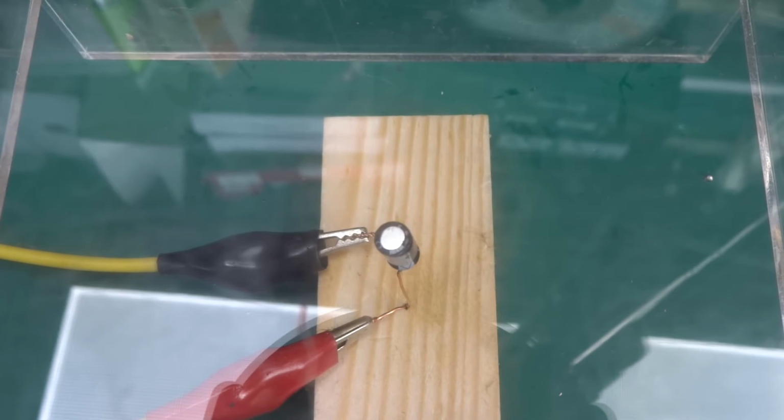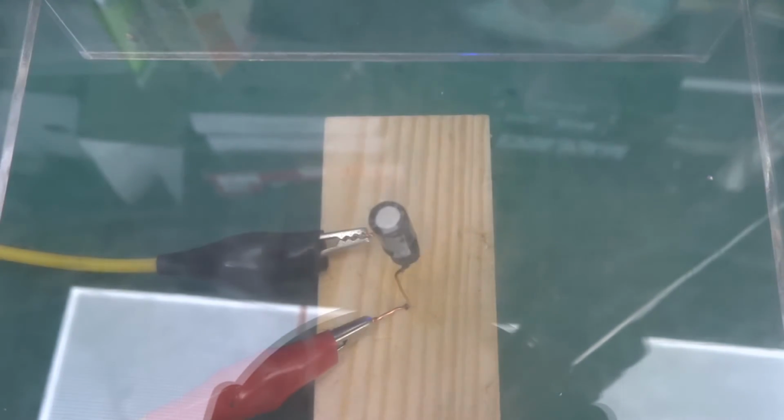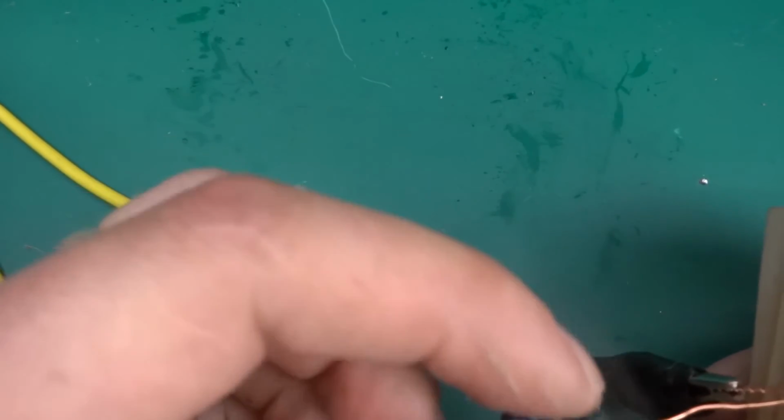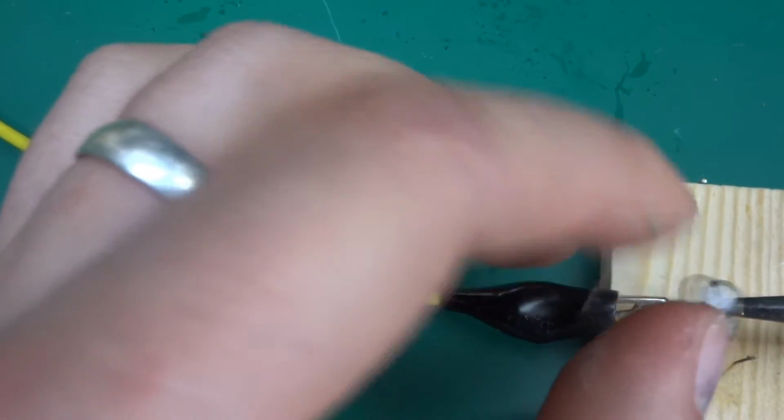So let's get this up a little bit. Make this quicker. 10 volts. Ooh, 600 milliamps. That's gonna go. Maybe not. The current dropped to 50 milliamps only, so let's up it again. Okay, that was 15 volts. And this one has also come out of its seat, but it's still in one piece, so it didn't go like a projectile.